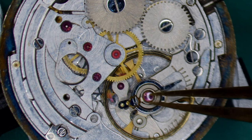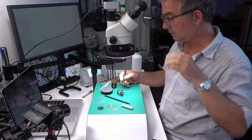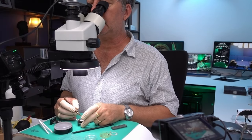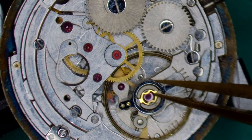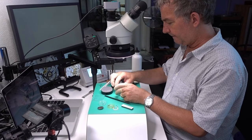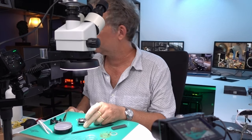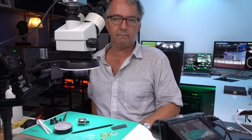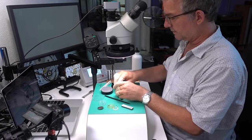So I think this is all good exercise for me to prepare for getting into oiling and all that stuff. The world of the inside of the watch just keeps getting smaller and more complicated. So that may or may not need a new balance staff with new pivots. Probably would benefit by that, even if it's not technically absolutely necessary.